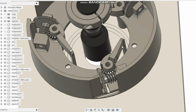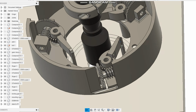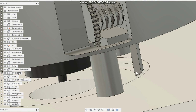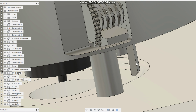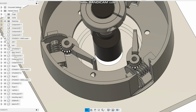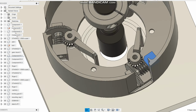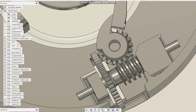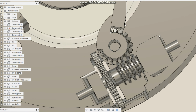When a force comes at the finger from the other direction, which is to say that you've pushed down on these standoffs and this finger hits the edge of the tub, that little wedge down there is going to move this finger. And when it does, it's going to retract. Behind this is a spring. And so when the finger moves, we're going to retract that spring.